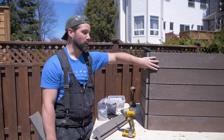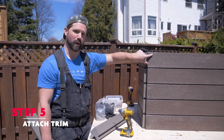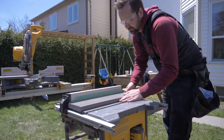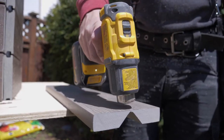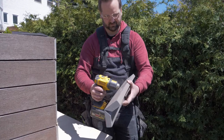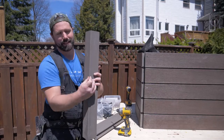Now that all of our composite boards are on the front, we need to put a trim on the corners to cover up these cut edges as well as the screws. For the pro DIYer out there, you can actually take a composite board, do a v-notch out of the back, heat it up, and actually bend it. As you can see, this is one piece — we cut out that piece of material, heat that up, bend it around, and now we have a seamless corner.